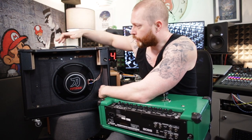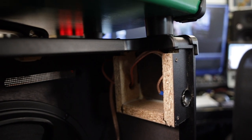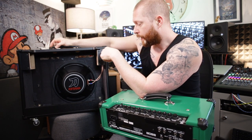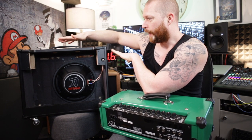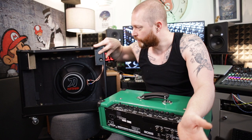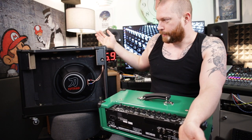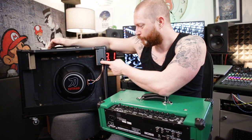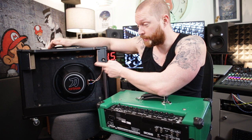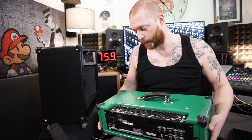There are four screws that go into the back, two through the top, and then the head just slides out — gives you a bit more space. There are these hollow parts here so I've just run a cable through here and fitted a jack socket to use this as a cab. But you could fit another jack socket above it and have that as the output from your head, so you could leave it all in the combo and have a speaker out — put a cable between these when you want to use it as a combo, or send it to any cab you want. The reason I use these Telecaster jack sockets is because they're small, they're black, so you don't really notice it's there.